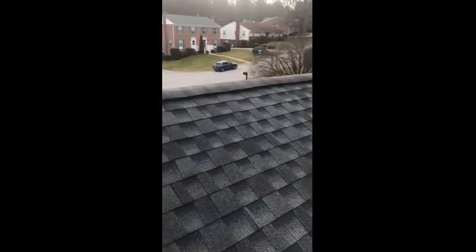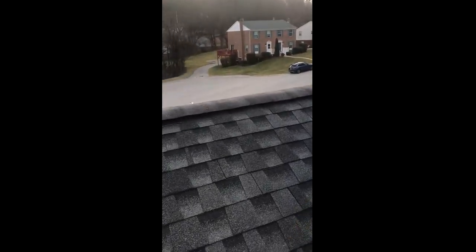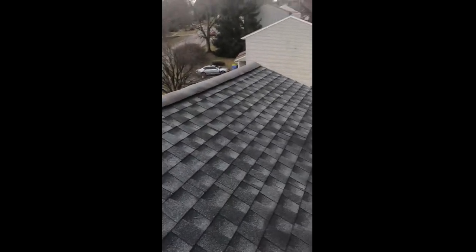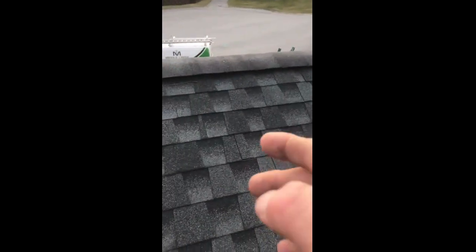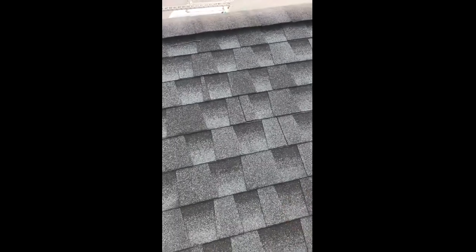The roof here is 28 feet in length and rafter spacing is two feet on center. So that means we come in 15 feet from the driveway side, 15 feet in and two feet down from the peak — and that would be your center of your roof ventilation fan, centered between the rafters.